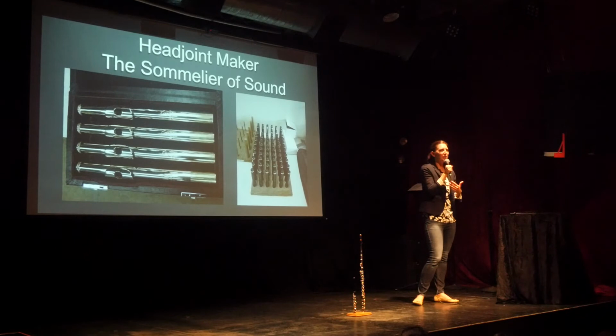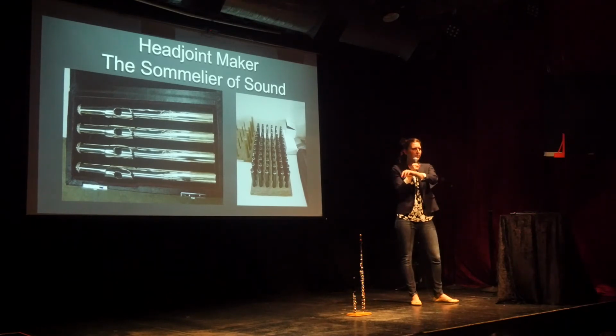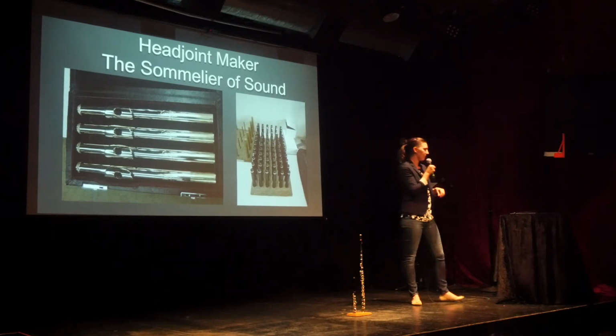So this is where I really want to talk about the art and the science of flute making. It really is, in my mind, kind of magical, because the science part of it is very clear. I mean, you don't mess with physics and math. If you put a tone hole, a hole in a flute, then that is going to give you a certain pitch because it's based on the length of the instrument that you're working with. So if you have a longer tube, it's going to be a lower pitch. A shorter tube is going to be a higher pitch. That's just physics, and that's not going to change. So you have to place all of these tone holes in the exact right acoustical place in order to get the right pitch. If you change the position, it changes the pitch.